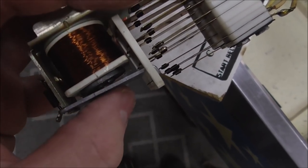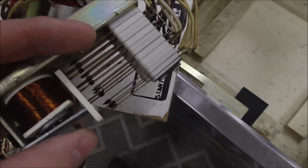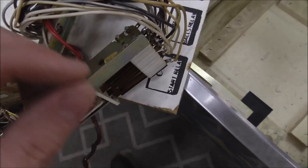You can do it with an emery board or a contact cleaner, or you can buy little things for it. What we use is an old needle file that's worn out so it doesn't have much abrasion on it, because you don't want to eat up the contacts. You don't want to go crazy on it. But you're basically trying to take all the dirt off of the contacts.